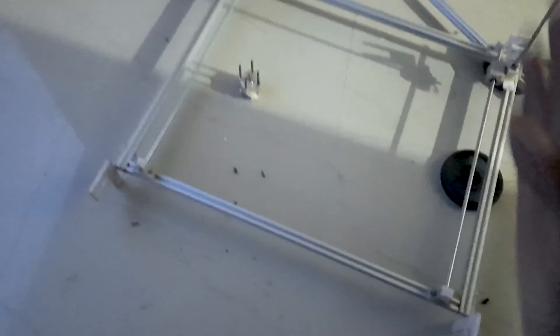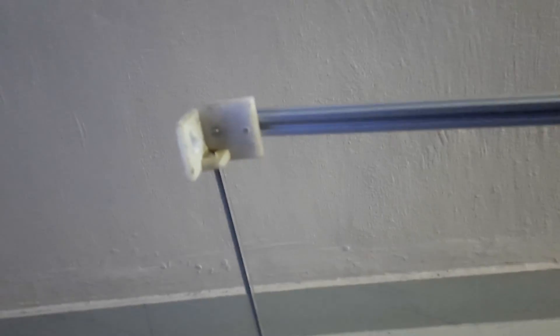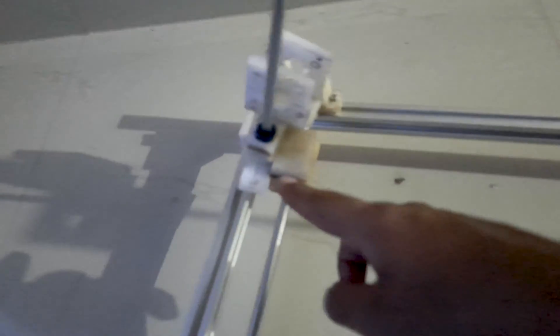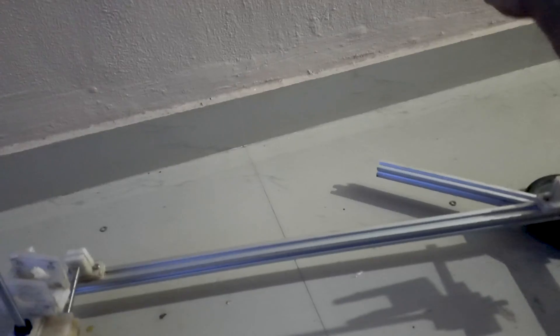This single aluminum T-slot is not able to handle the slanting or lateral flex, and because of that a new problem has come out. It can just flex like this — left, right. That is happening because there is just one LM8UU bearing, a circular one inside, so there is nothing to support.